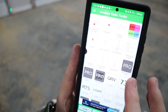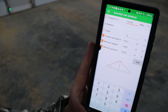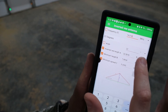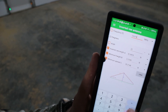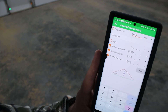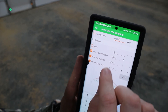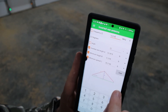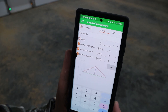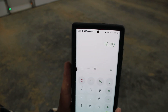The first thing we need to do is get a calculator and calculate the distance. I want to do this on 20 meters centered on FT8, so I punch that frequency into the calculator in megahertz and it calculates out all the measurements in feet. One thing I didn't realize at first is that 'A' here is the entire length. Since we're using lamp wire and cutting it in half, we need to split the 32.5 feet in half — so each leg needs to be about 16 feet and 4 inches. We're going to make an inverted V antenna, which is one of the easiest antennas to make.